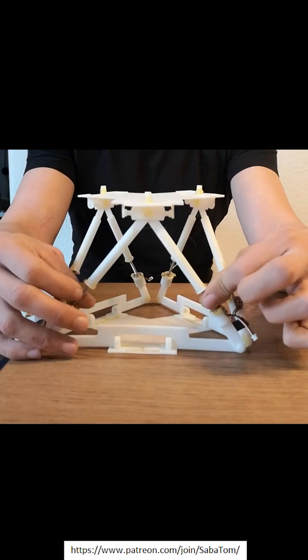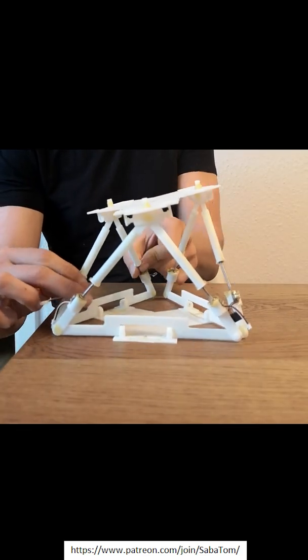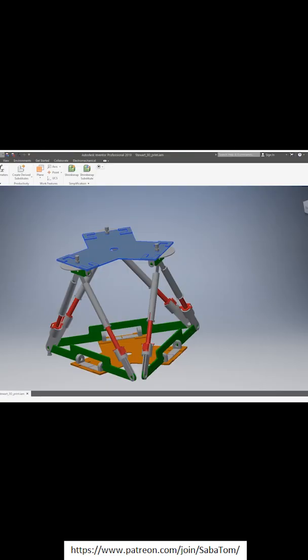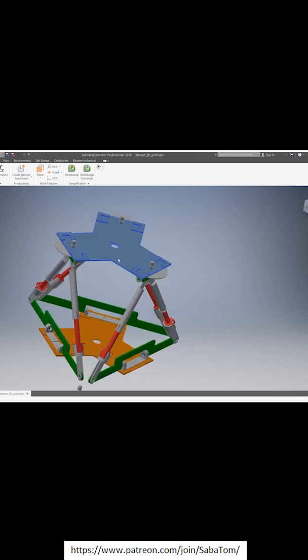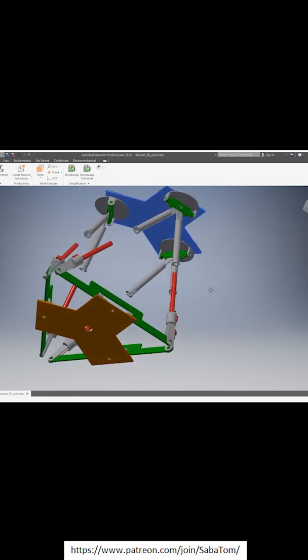Here is something that I think I may have invented some years ago. I've been looking around and couldn't see anything like it ever since. It's a Stewart platform but with a unique configuration which makes it statically determinate. It uses only hinges — no shoulder connections — which are aligned to share the same center of rotation, making a universal joint.